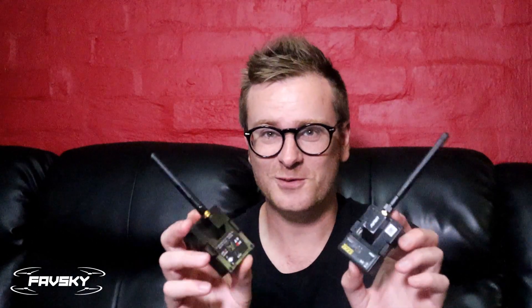Between the TMX5 and the Jumper 4-in-1, if I were to directly compare the two, get whichever one you can find cheaper — also look at the generic version. They all do the same thing with some nuances. The TMX5 fits perfectly into the Nirvana; with the Jumper JP4-in-1 and the generic Jumper module, the pin side won't click in all the way, which is a bit annoying. You could hack at it if you're saving 10 or 20 bucks, or just leave it since it doesn't really fall out.